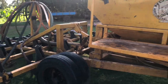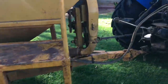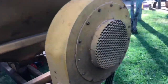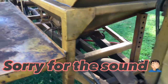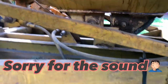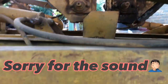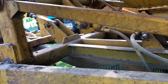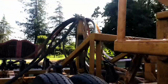The chisels are generally part of the distribution system. Up here is the seed hopper, and there is a fan where the air system is — inside is an air delivery system. Air seeders employ air pressure or a fan system to transport seeds from the metering system to the ground. The air delivery system moves the seed through tubes or holes and directs them to the desired location in the field.